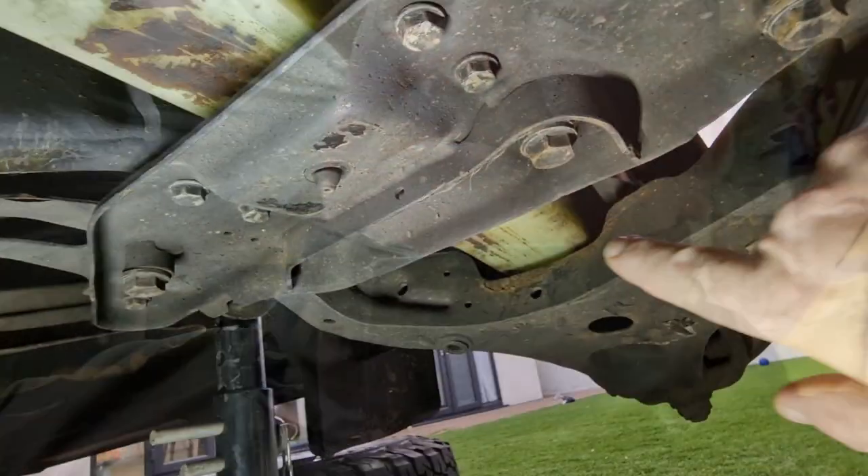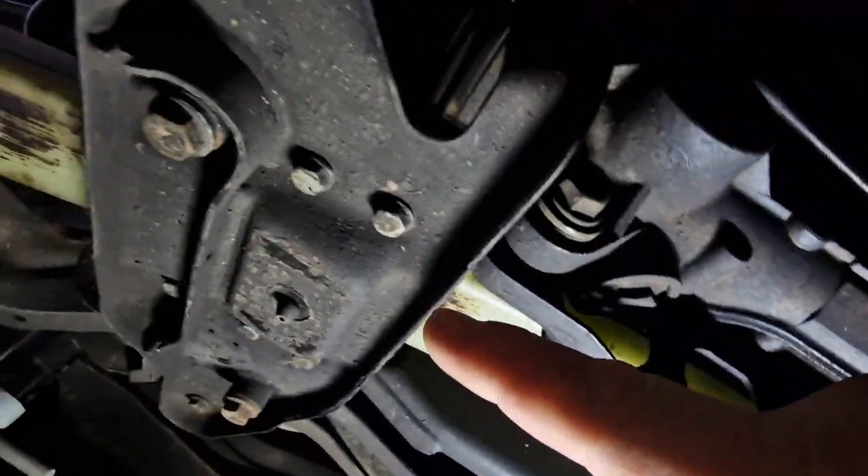It started as soon as I did the work and we never had that noise beforehand. I inspected the dampers, had a good look around the front end - nothing there. The only thing I found that we didn't do was change the rubbers. The rubbers for the 5-tonne spring look exactly the same but have a different part number - all I can think is this is a harder compound. So this week's video we're going to be swapping them out and also sorting a squeak on the brakes. All last summer if you ever met us you would have heard my brakes squealing - just a little chirp, but it pisses me right off. Let's get stuck in.